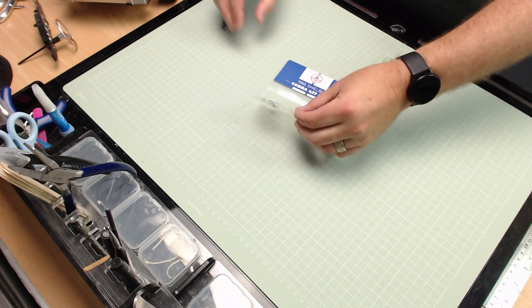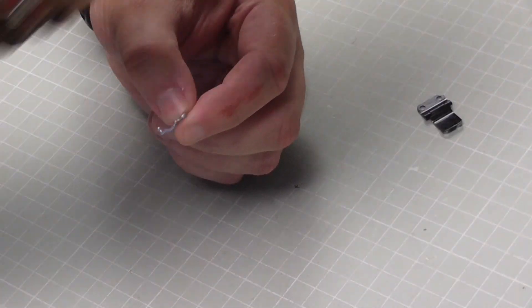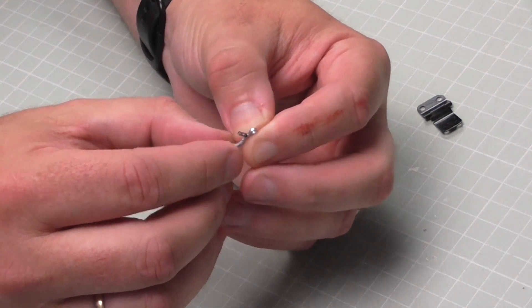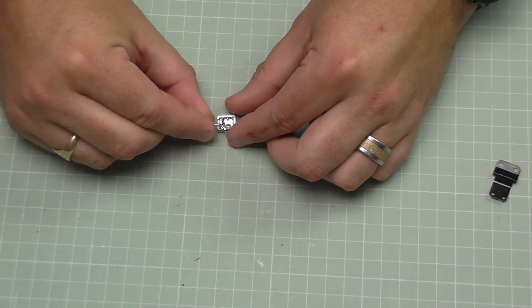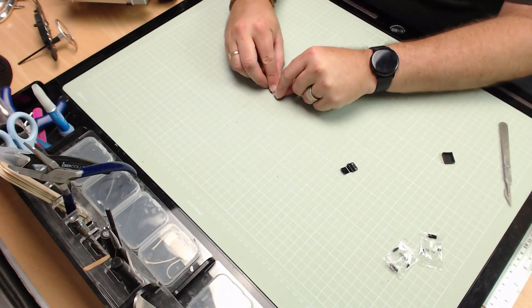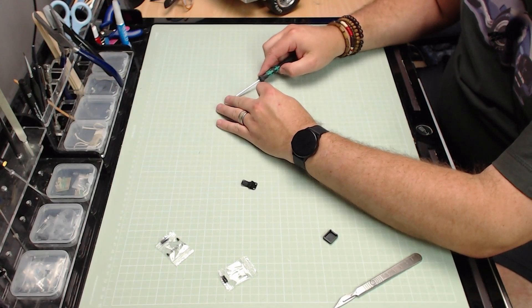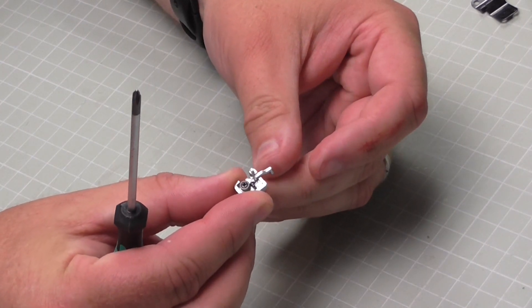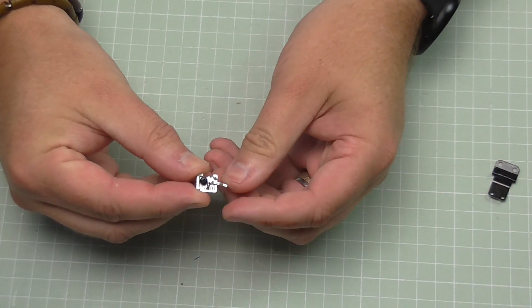We are going to be starting this stage with the door hinge and mechanism. We've got this tiny section which is going to have this tiny spring just going above the pin there, just like in the picture. Be careful because the spring can ping off in all directions, but it does hold itself in there no problems. We want to put this whole unit into this square base and hold it in place with an OP15 flange screw - it's very tiny. Line that up slowly, make sure it's bitten, tighten it up - not too tight because we still want that catch to be able to move when it's on the door. That looks perfect.